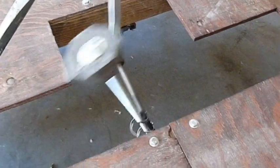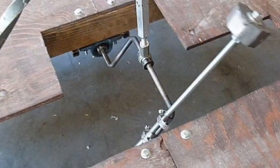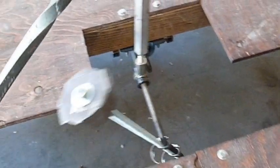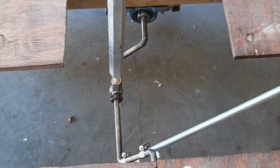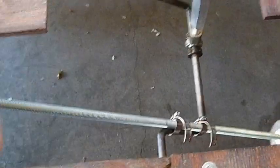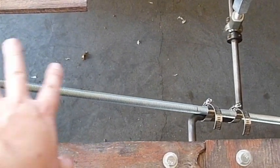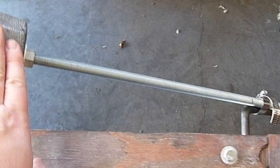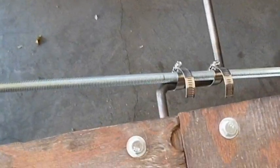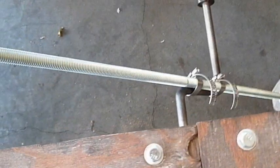But there was still some difficulty with the top and bottom, so I knew this wouldn't be good enough and I wanted to add more weights. With a flywheel, what you're going for is rotational inertia, which is a function of mass but also a function of the radius out from the pivot — from where it's spinning about. So just adding more lead weights in here wouldn't be as efficient, and also this is just half-inch all-thread — it would start to bend a lot if I did that.